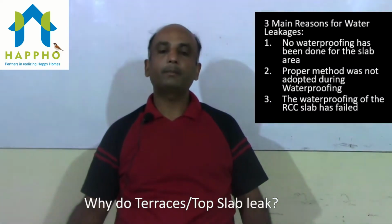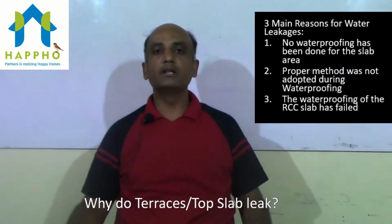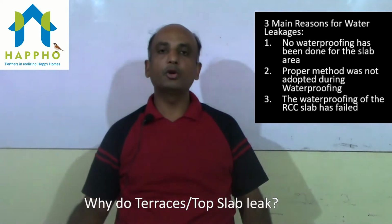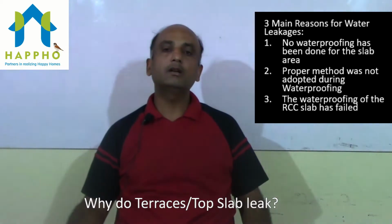Leakages from the top slab can happen because of three reasons. Firstly, if no waterproofing is done on the slab. Secondly, if the right method is not followed while doing the waterproofing. Third, because of general wear and tear in due course of time.